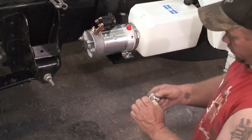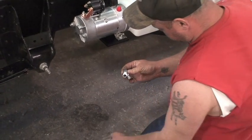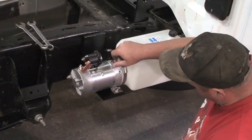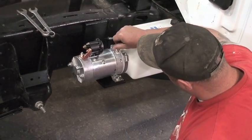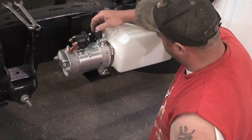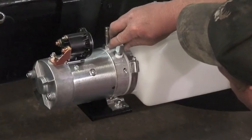Once you get it mounted, it's time to start hooking up the plumbing. In this particular case we're using Teflon paste, though any suitable pipe sealant would be sufficient. Being a 90-degree fitting, there's not enough room to make a full rotation to thread it into the unit. So the control valve solenoid coil — the black plastic square bolted next to it — can be removed. Remove the nut off the end of the stem and slide that black coil off. There are no moving parts inside; it's just a coil of wire.